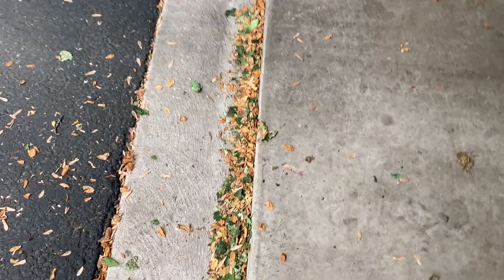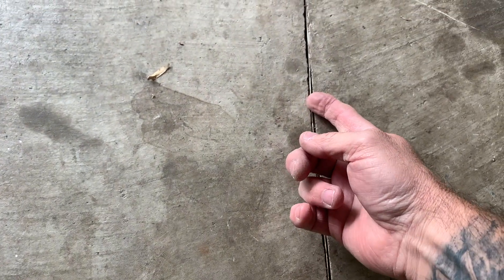Today we are going to terminate this floor at the upper joint right here. We have some ugly joints in the floor that we just can't seem to get away from. We're going to be filling these joints. This also has the plastic zip strip in here — this little plastic strip to determine where the floor cracks. They're not straight, which is very common. So we're going to open those up the best we can, fill those with a polyurea joint filler, and get at it.